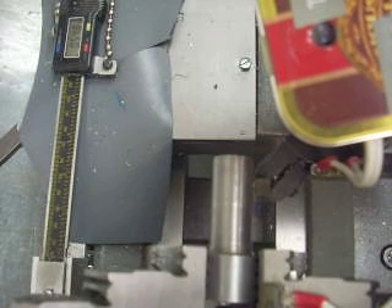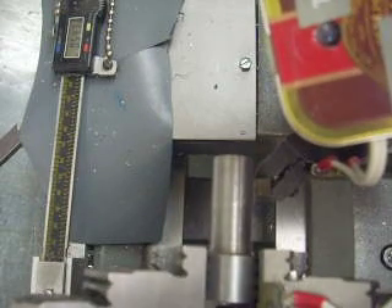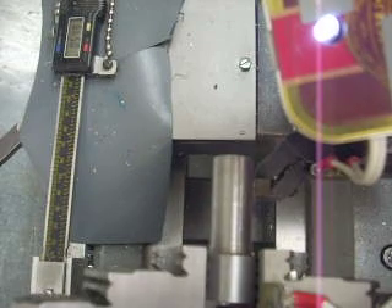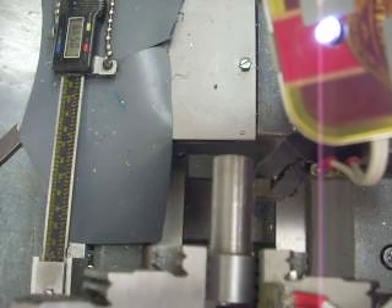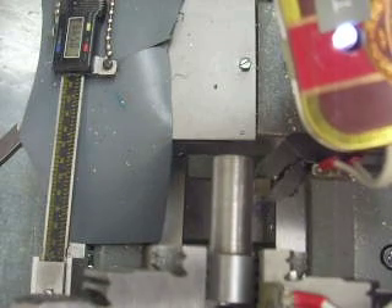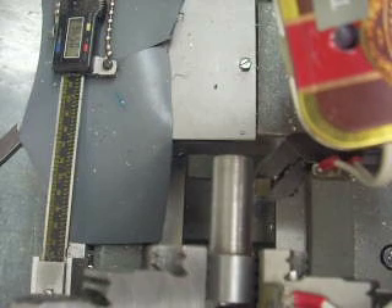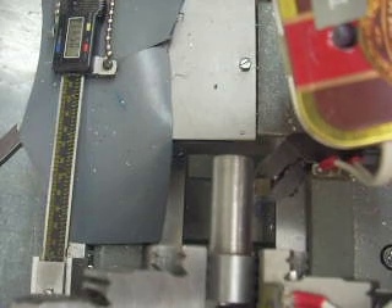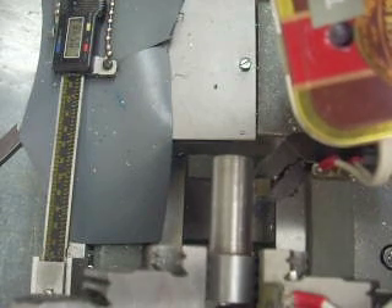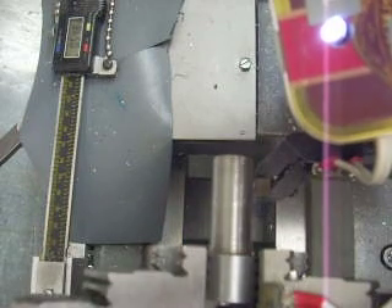On a lathe with closer to five thousandths of an ohm resistance, it flashes a minimum of a tenth of a second — still quite readable. So I feed in, the light turns on, I then zero my dial and come back to test and make sure I'm okay. Right there — a thou away, half a thou, right on. You can see the light lights up.